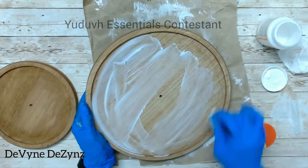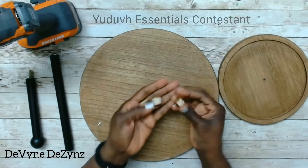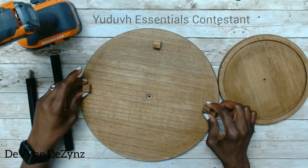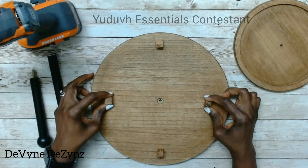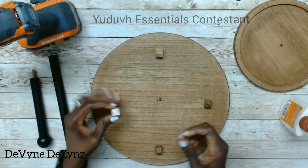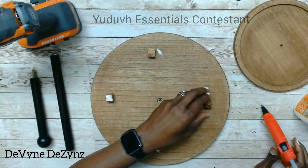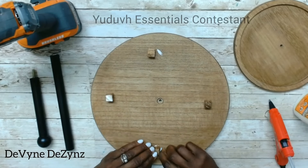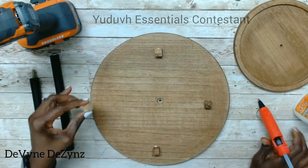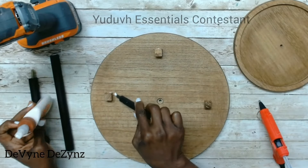At this point I had only planned to stain it and leave it plain, but I decided it needed something to stand on since it was lying too flat. I initially added three small cube legs but realized I needed a fourth, so I stained all four. I'm applying them with wood glue and hot glue. Important tip: if you stain or paint a surface before applying wood glue, adhesion is very poor. I left one section of each block unstained so the raw wood could bond properly to the tray.